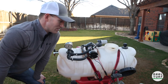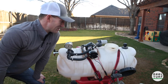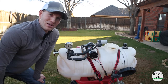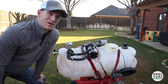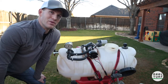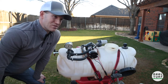When you have a loss of pressure, I think for most of us the first thought is the pump's not working. But it's just not the first place to start. As long as you take care of your pump — keep water out of it when you're done, store it properly — you're not going to have an issue. All it is inside is a little impeller that looks like a fan. It just spins, and that's how it builds pressure. A pump is very simple — just a motor that spins that impeller. Unless that gets damaged, you're not going to have an issue.